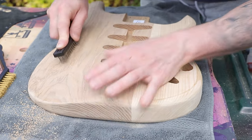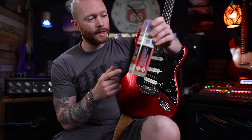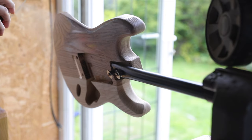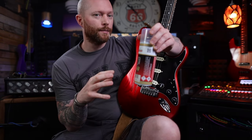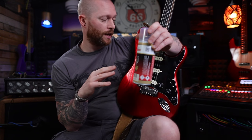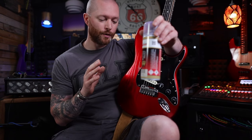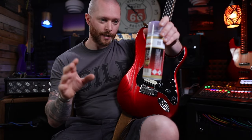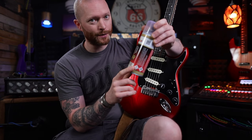Once you've finished with the wire brushes, go over the whole body again with some 400 grit sandpaper, then apply your sander sealer — two or three coats. Wear a full face mask; I'll put a link to mine in the description because this stuff can make you feel quite ill. Go about 20 minutes to an hour between coats depending on temperature. Also, you don't want it to be too humid, as that can cause problems — the finish can go a bit misty. Two or three coats, then leave it 24 hours to dry.